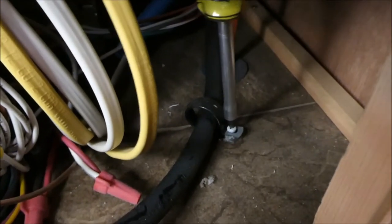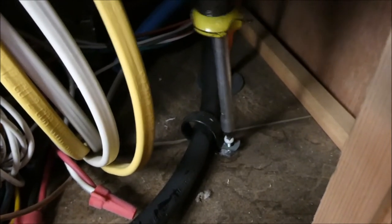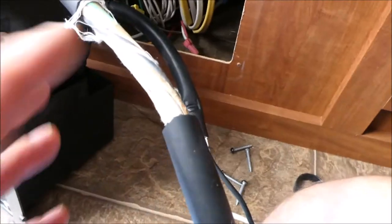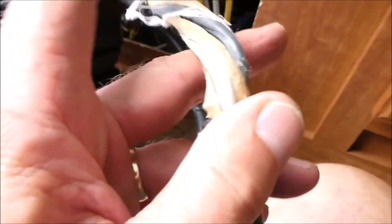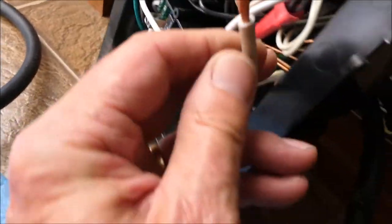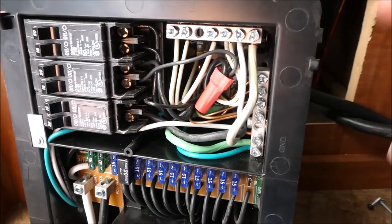I'm going to make this cable look exactly like this one and clamp it back in there and hook the wires back up. I very slowly and very carefully used a box knife to cut through this outer insulation, bent this over, cut through there very slowly, very carefully, so as not to nick the insulation on the three conductors inside that jacket. That clamp is secure on the new cable. I'm very carefully stripping these 10 gauge wires. All these AC wires are now secured.